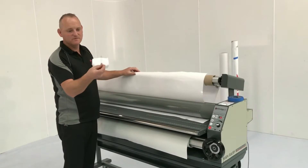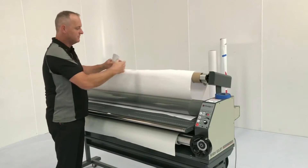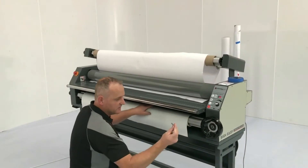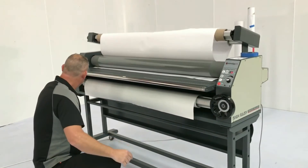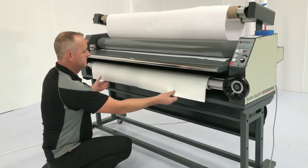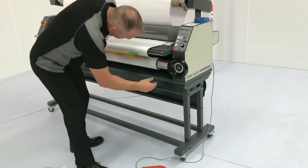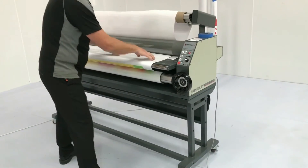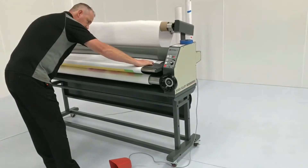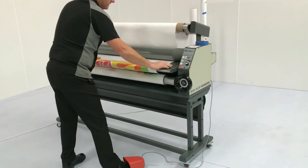What I'm trying to do is just get a couple of layers of paper to get to my rewind, and we'll stick that to the old release paper. To do that we need to use a piece of film or a piece of media — if we use normal tape, like masking tape or whatever type of tape, it will let go. So we use scrap film or scrap media to join that. Next we need to make sure our lock pins are in our print mandrel — this just stops any chance of it jumping out, especially when it gets to the end of the print if it's taken onto the core. Now I'm just going to check our liner as we did before — looks pretty good to me. And then I'm going to use the foot pedal to start the machine, using two hands spread right over. I'll start the machine, and in goes our new print.